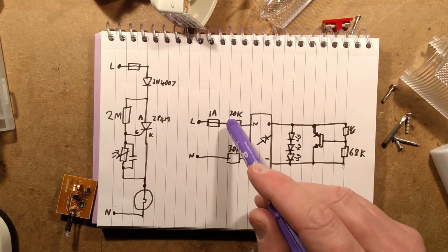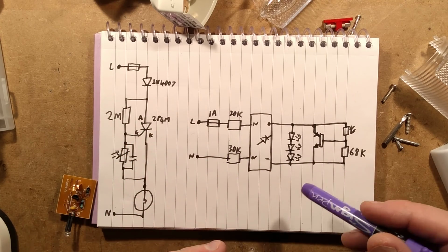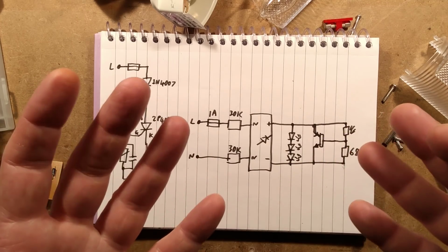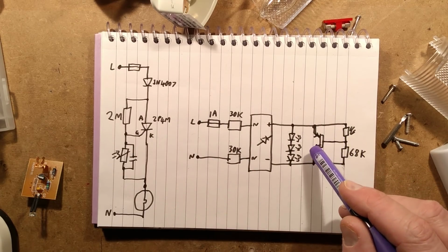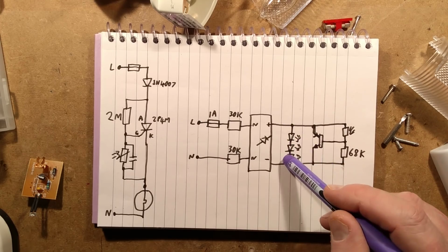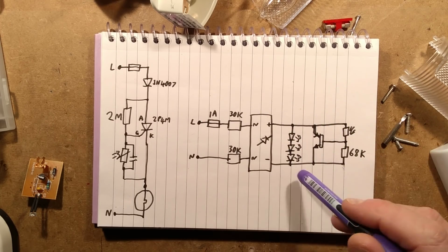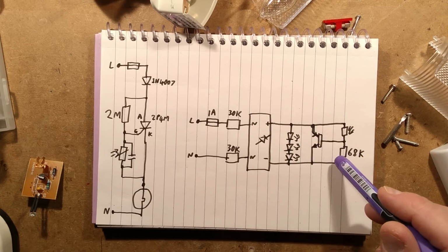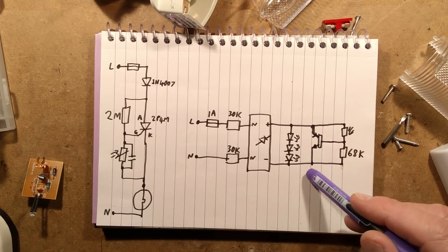So normally that transistor turns on, it shunts the LEDs out, but that means that during the daylight, these two resistors are dissipating that power, which is the thing I was mentioning about how it's not that efficient. But the reason they do it is it's just the simplest possible circuitry. I've only ever come across one LED nightlight that tries to actually break the power to the LEDs. And ironically, the circuitry was so stupidly complex to do that. It had to derive a separate power supply for that section of circuitry and pretty much drew the same current as the LEDs. So this is just the absolute easiest.